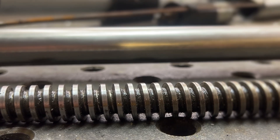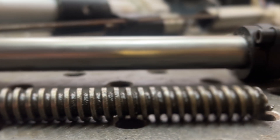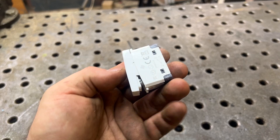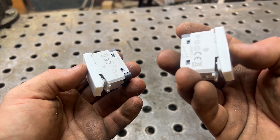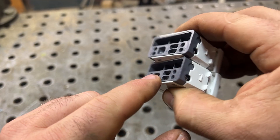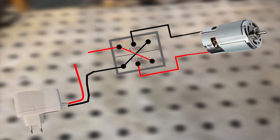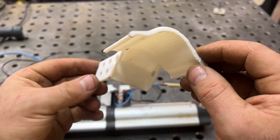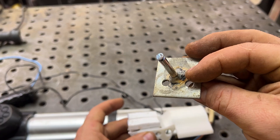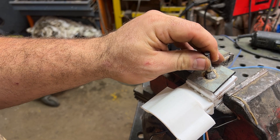The motor itself is a 12-volt motor. I also dismounted all the parts of the piston so I can clean them and apply some oil and grease so everything moves smoothly. I take two switches — this is so important to change the polarity of the motor. This is a three-connection switch. I connect both of them so we have six points of connection and I can switch from positive to negative so I can make the piston extend or retract without problems.